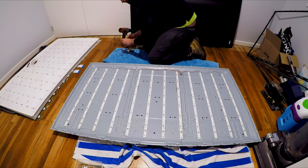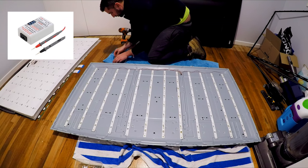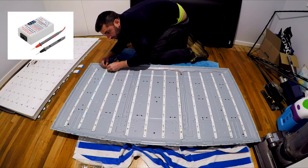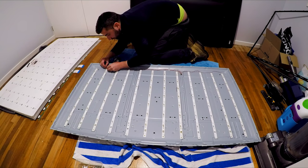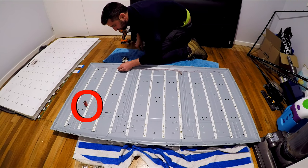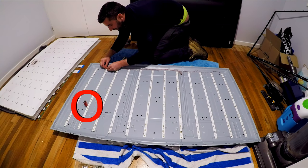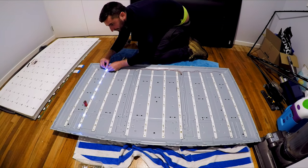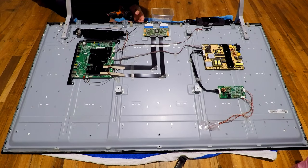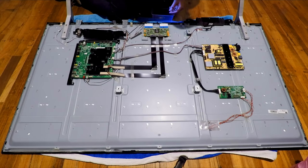Now, a better way of testing these lights before you strip down the whole TV is to get an LED tester, link below, and you can test these LEDs just from the wiring coming from the back of the TV. This way you won't need to strip down the whole TV to test the lights. But if you want the El Cheapo way of doing it, you can strip it down, if you feel quite confident, and test the strips individually. Generally the TV will start up and go into the main menus, but as soon as you switch it to a TV tuner, this is when the TV will cut out.